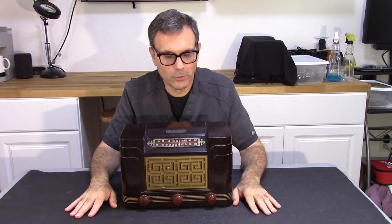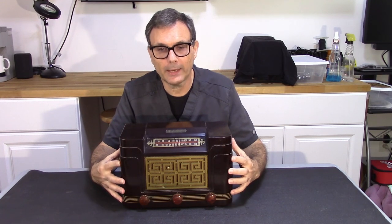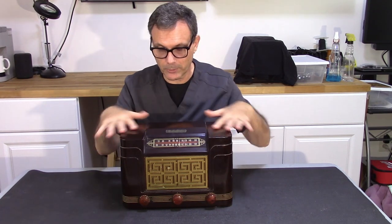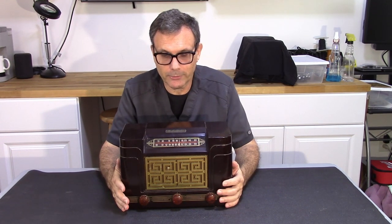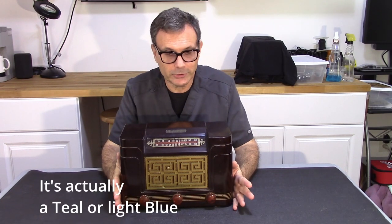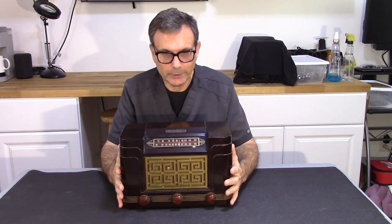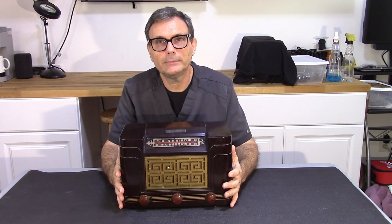And I'm going to basically go through the radio. I know I need to recap it. Obviously, we're going to repaint the case to the ivory color that he would like it to be. This thing came in three colors. It was in brown, which is this color, an ivory, and I believe it's kind of a light green. I've never seen the green version of it. Definitely replace the electrolytics and, you know, tune the thing up and get her working again.